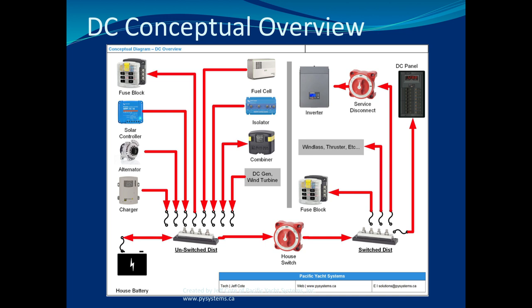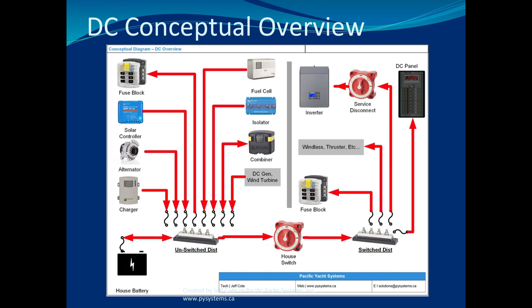And that's the thing with electrical. I give that analogy all the time. Moving a decimal point on a number doesn't seem like a big deal if you don't understand what it means. Move it one digit to the left or one digit to the right, that's a factor of 10. Your paycheck goes from $100 to $1,000, or the opposite, from $100 to $10. It makes a big difference where that little decimal is. And with batteries and electrical systems, moving a wire from one location to another that could be 2 inches apart is a world of difference. So if your battery charger is connected on that battery switch post right here, moving it 2 inches to this side will solve that problem.